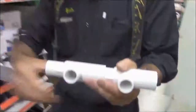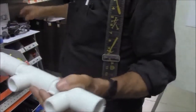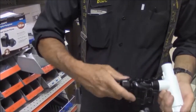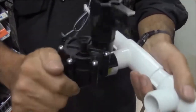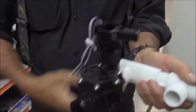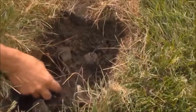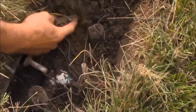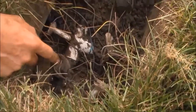In the old days, we made manifolds out of PVC — I still do sometimes. You put two or three fittings together, put a threaded cap on the end so you can drain it, and screw a valve on. This is the old glue manifold. It's just fine — you can see the white PVC — but if you wanted to change a valve later, you were kind of out of luck.